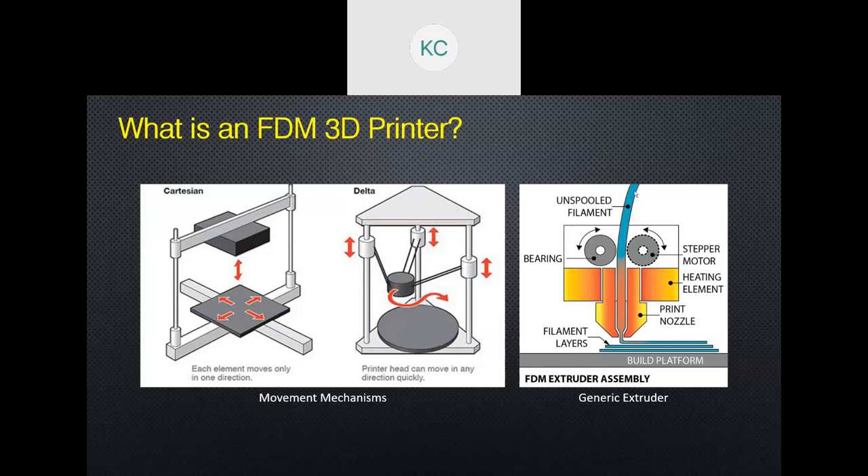The blue part is actually the cool filament from the reel, which is pinched down with the stepper motor onto the guide groove, then pushed all the way to the hotend and extruded at the width of the nozzle. Layer height is something which affects the resolution of the part, but there is also another factor which limits the XY resolution.